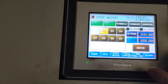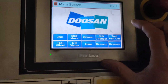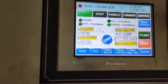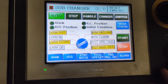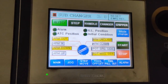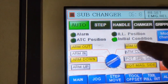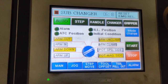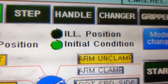When you are done, remove your step selection and go to main. This is the sub changer screen. If the sub changer hangs up, or you suddenly reset the machine while doing a tool change, this is the screen for how to recover it — but doing this takes a little bit of time, so I will cover it next time. If you have a problem, check if the initial condition is not blinking. If that green button is not blinking, that is a hint that you have a problem.